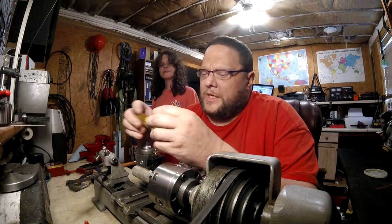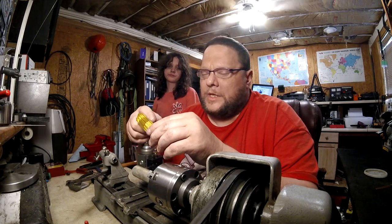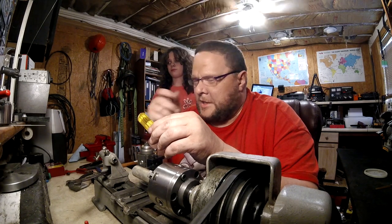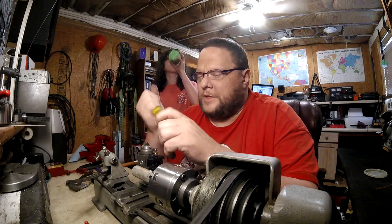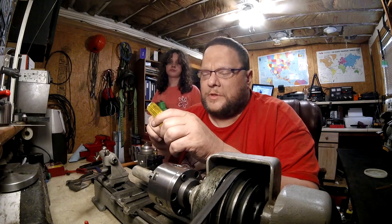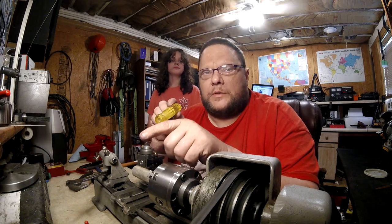What I've done in the past, and I learned this afterwards, is you drill it out, and then you put a bolt in there and run it down until it hits. Then you beat on the end of the bolt, and you leave it a little bit proud, and eventually when it mushrooms up a little bit, it transfers the energy straight to the blade of the screwdriver.